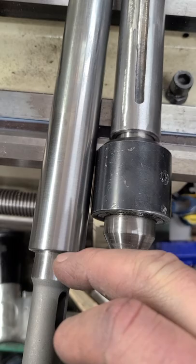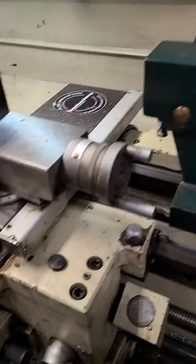So all I have left to do — I'm going to set this up. Like I said, this is just an adapter. I did cut the Morse taper in there. So if you go to your machine manual or pull up on the internet, the taper is about one and a half degrees-ish. You can pull it up, do a Google image search, because everyone always asks about different things. Everything you ever want to know you can find in the machinist manual, and it'll give you the dimensions on there.